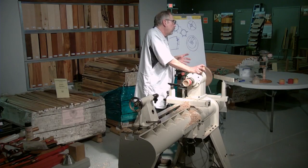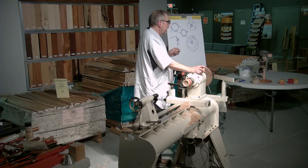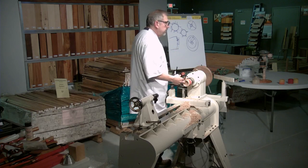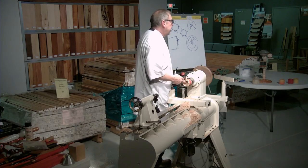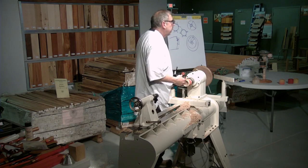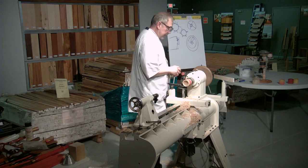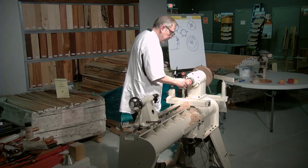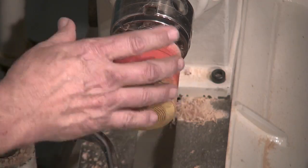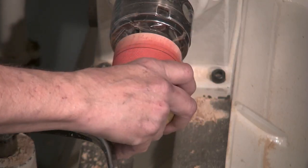Depending on how seasoned your wood is, it can be tighter or it can be looser. Generally, now that I've run this, if you use a Forstner bit, I can tell you it's going to be tighter. The reason is that the Forstner bit gets the wood really hot. You've heated this wood up and it's swelled up a little bit, so it's going to be tighter than it was before. That means if I fit this top perfectly right now,